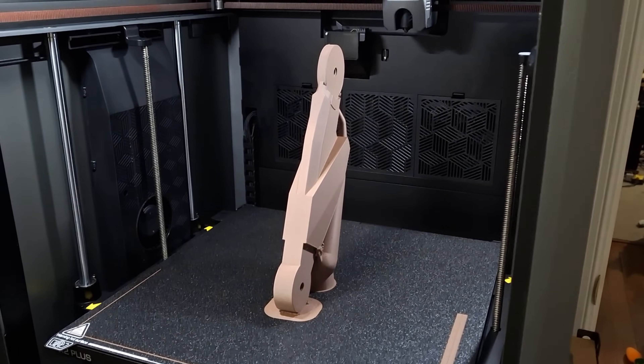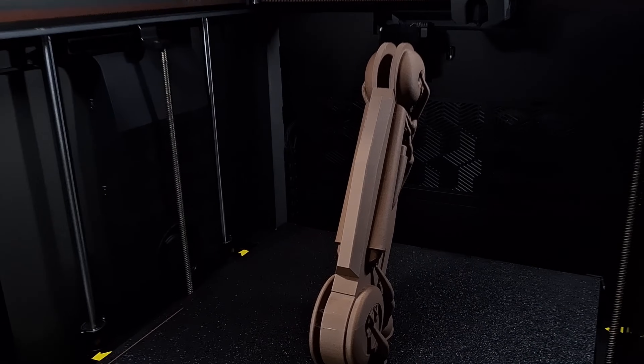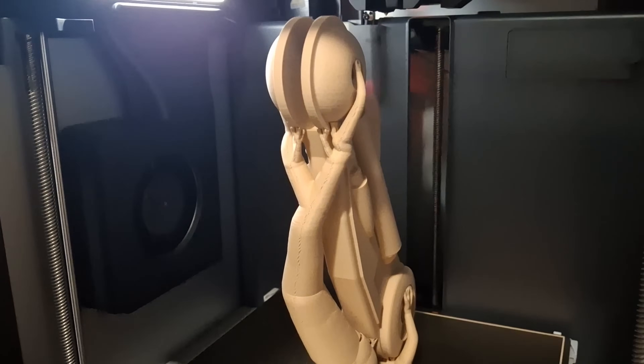The prints finished faster — negligibly, like maybe 10 to 15 minutes. Speed isn't the biggest thing for me at all because I can't finish props as fast as the printers can do them — I get a huge backlog. But if that's important to you, great. The quality is what's important to me and the quality has just been phenomenal. There's another thing that makes the quality sometimes better: print orientation. When you're using the Bambu, sometimes you have to lean things back weird because it won't fit in the build volume, creating more overhangs. With the K2 you aren't restricted — you can angle it any way you need because it's so big, giving it the best print orientation for an even better print.